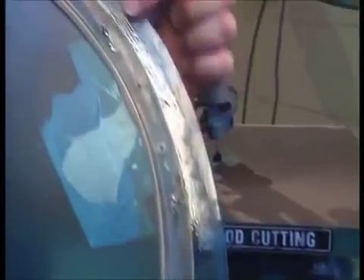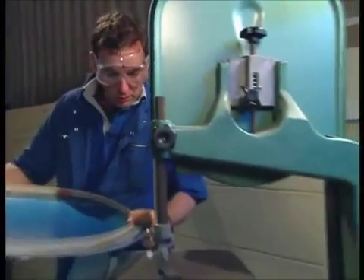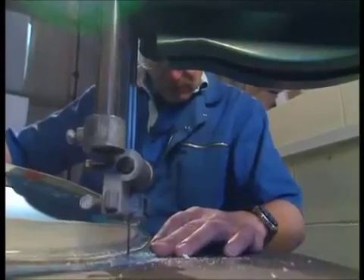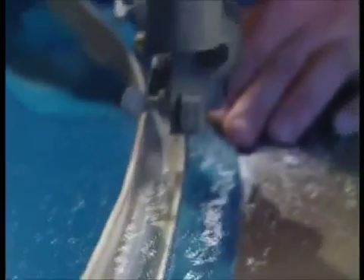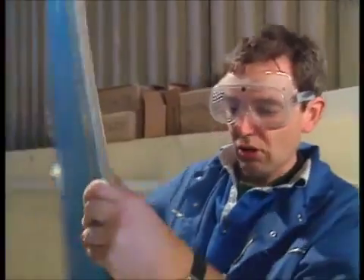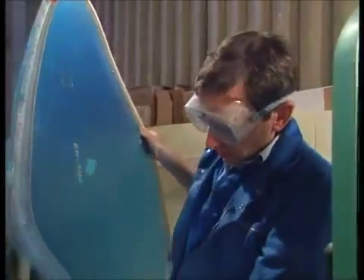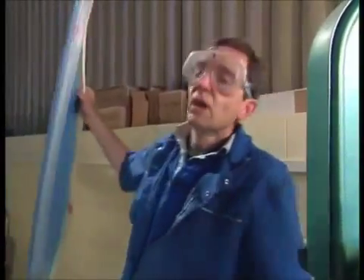The band saw is the perfect tool to cut off all this excess plexiglass. We don't need to go right down to the edge of the frame because we can always sand it down for the last bit — we just need to take off the major part that is too big. The key is to keep the bit you're cutting flat to the tabletop. Getting there — just got that little edge down there to do. Not a bad job; not too much sanding to do.